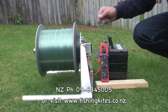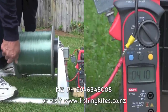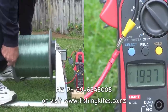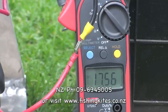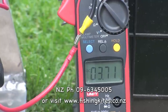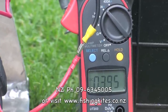So when this is in the on position it draws very little — about the same as a normal winch. As it starts getting under load, it builds up a lot more slowly than a 150 watt motor. That would be an extreme load — I'm grabbing the sides of the rails here about as hard as I can. I don't think I could stall it, and as you can see the amp draw is minimal. Do that with a 150 watt motor and you'll see it surging possibly as high as 40 amps. This is a really efficient rig.